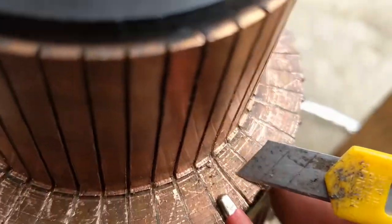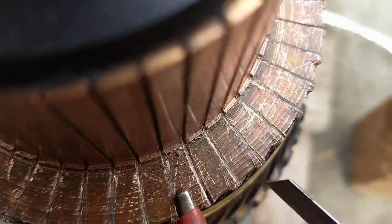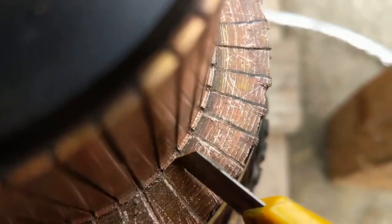I think this really might be the problem - maybe it became too hot, and then the torque, the twist here caused these layers to short. There's a short circuit here and it was really quite difficult to get a clear gap between these layers.